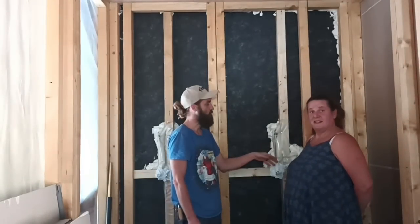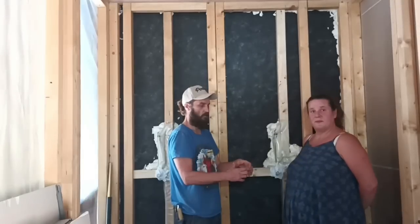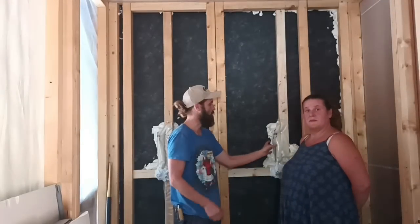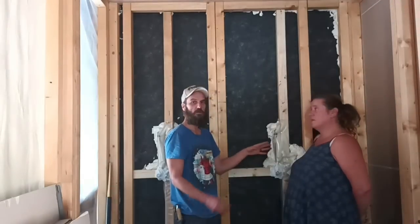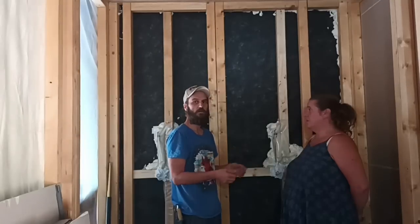in the walls, but putting plastic around it creates like a hollow space. And if you leave that open, I think with the hot and cold, it's going to create moisture in that little plastic bag and ruin the insulation and studs. So what we did, we filled them up with foam, so at least it's not a hollow space that's going to create the condensation and so forth.